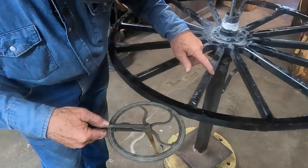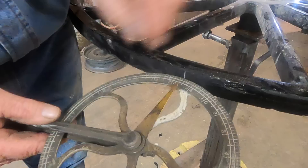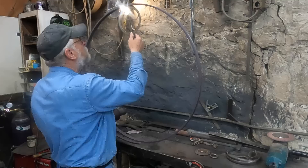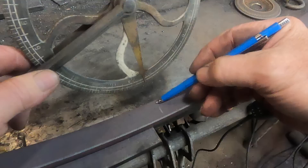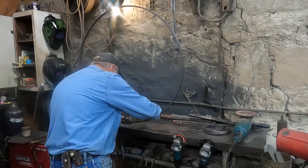Counting revolutions — one, two, three, four, coming up on five. So I'm going to put my pointer at an eighth inch shy of my mark. It's just a matter of counting the same revolutions and transferring my mark to the iron. This is where I will mark it, actually where the pointer is — making this iron an eighth of an inch shorter in circumference. And since I am dealing with such tight tolerances, I do like to double-check my measurement.